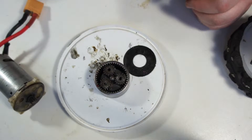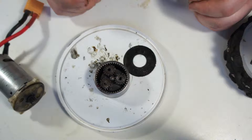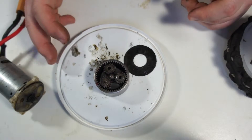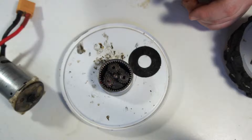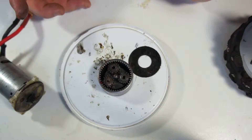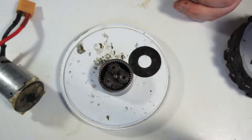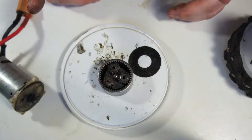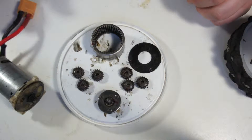Now you can take that ratio and look online. In my case I'm looking at the P60s or P61s. The closest P60 gearbox is 38 to 1 - very similar, so they'd perform pretty identically. With the P61s the closest options are either down to around 28 or all the way up to 64. Being that the 38 to 1 is closest to what I had and it worked really well in competition, I may end up going with the P60 at 38 to 1.